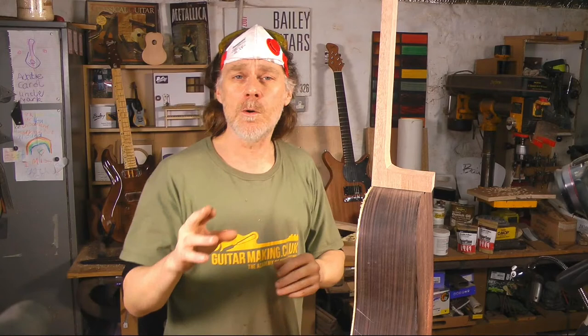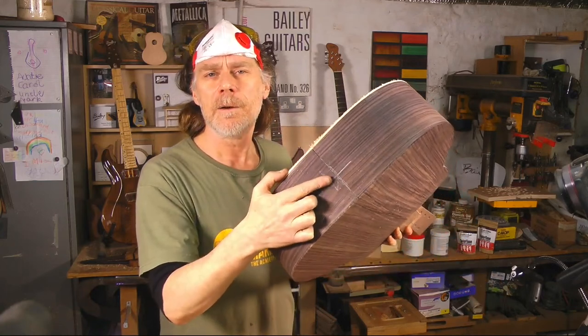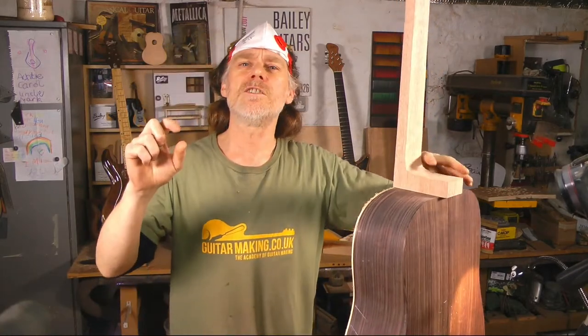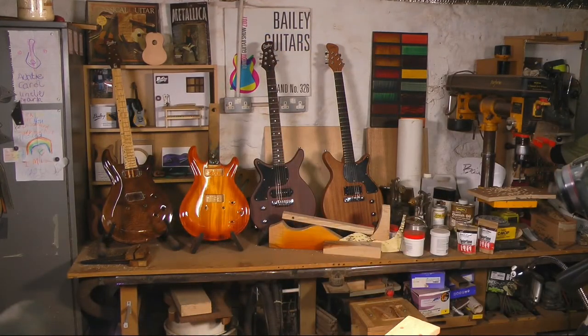So what I will do is I'll very quickly now tell you how I would do it. You can, of course, buy a very expensive drill, especially for drilling the end pin holes for the pickups on acoustic guitars. But it's always a half inch hole, 12.5 mil or half inch. So I'm just going to put that down in case it falls down. So what I would do is use my whole range of drills. Start with a small one, and then go with a bigger one, and a bigger one, and a bigger one.